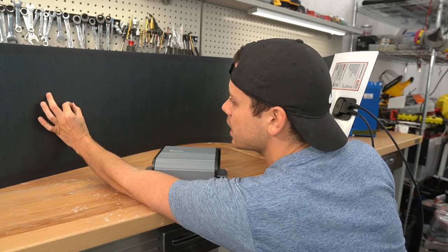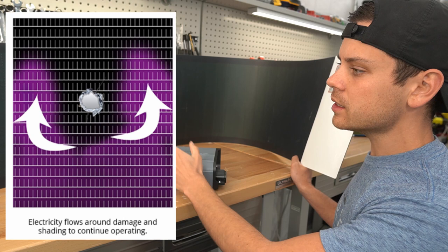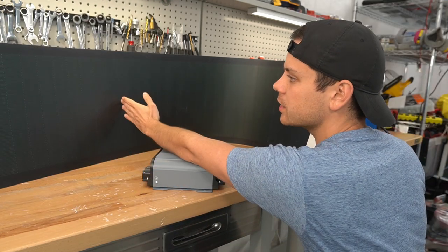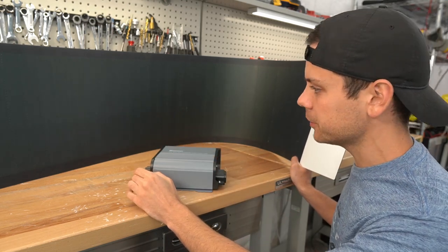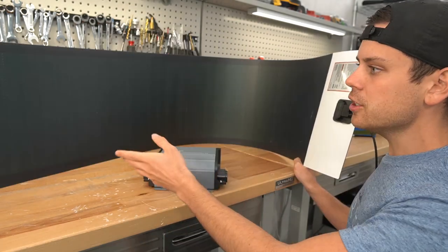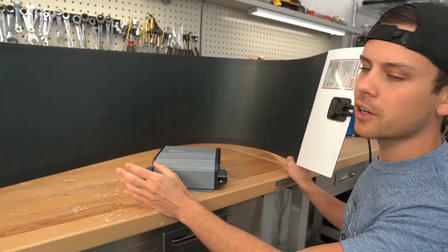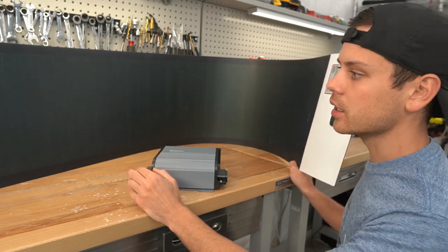Because this is a thin film you can actually bend it and it will not crack like the cheap ones on the market. If you were to shoot a bullet right through it you'd have less output but it would still work. These handle shading very nicely — covering half with shade only produces 50% of rated output. The cells can be flush mounted to your roof, they handle heat nicely, and the newer CIGS panels have improved output for their size compared to earlier versions.